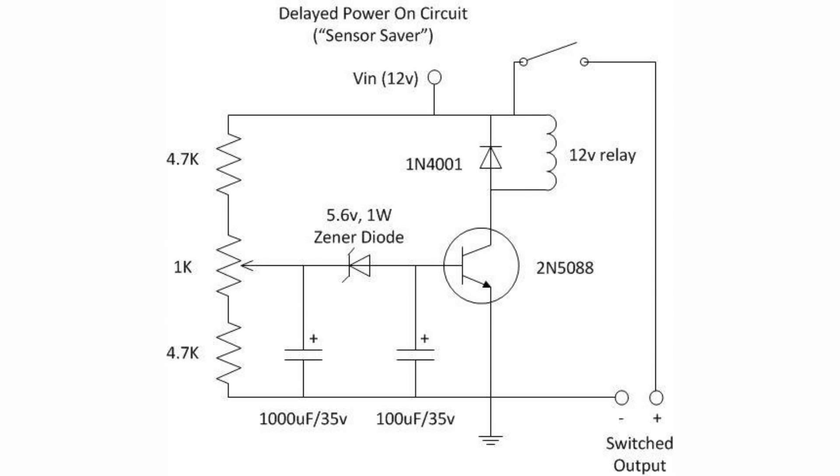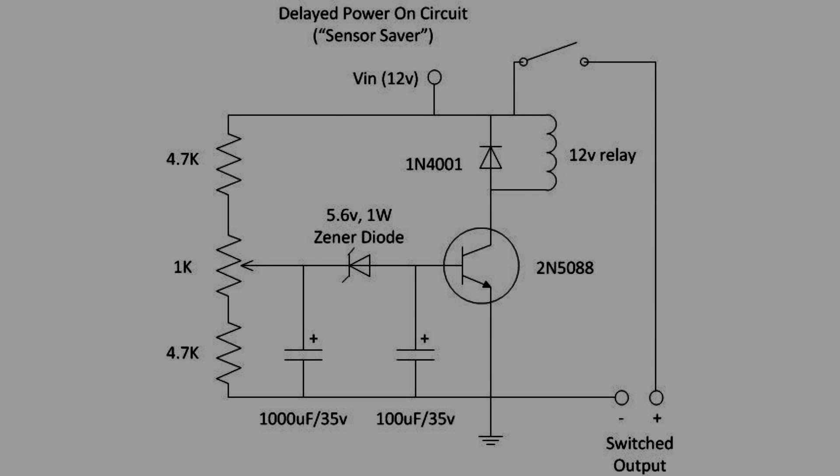Here's the completed Sensor Saver circuit diagram. On the side you can see the variable resistor — we've added two other resistors at the top and the bottom to add an upper and lower limit to the timing range. Here's the capacitor. And here's the Zener diode that will trigger when the voltage out of the capacitor reaches a certain level — in this case, 5.6 volts. Here's the transistor that gets triggered when the Zener diode finally starts conducting, and we've added a small capacitor here just to absorb any spikes that the Zener diode might produce. When the transistor fires, it triggers the relay with its diode to help protect the rest of the circuit.